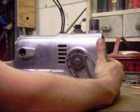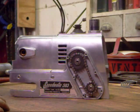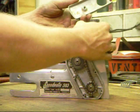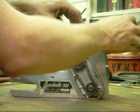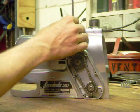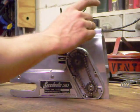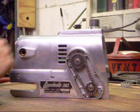Now you can see the mechanism that drives the rear roller. We're going to install our trim cap over the top of the sander, with these two wires routed out the back — it's important to make sure they're not pinched by anything. There is no gasket that goes under this, because it really doesn't serve any function except protecting the wires. The dust collection goes straight from this tier down to this housing, and there's usually very little dust accumulated here over time.